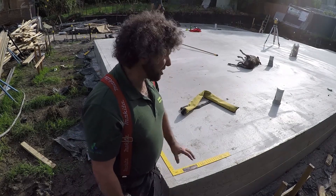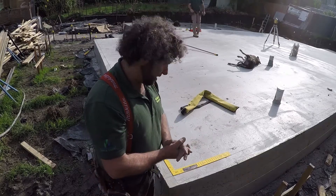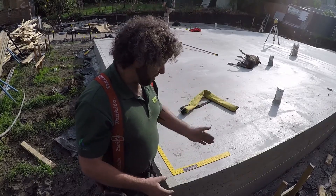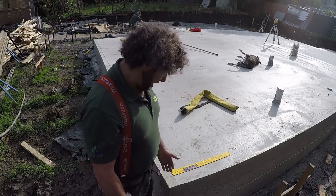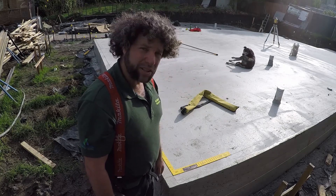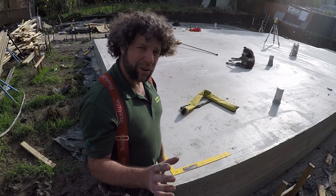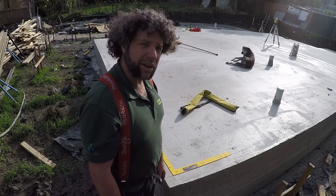The bottom part of this detail shows brickwork at the base. Some of these formwork sections have bellied out slightly with the amount of concrete pressure, so what we're going to have to do is flick a line through and chop some of this rebate off, just to create enough area for the brick to sit on and to finish off that detail to our build lines.